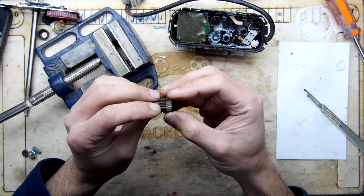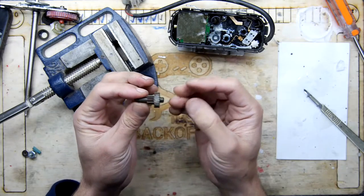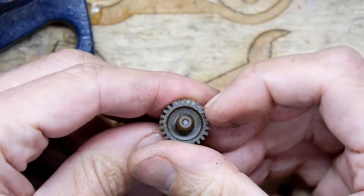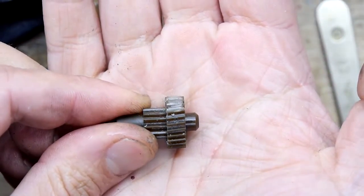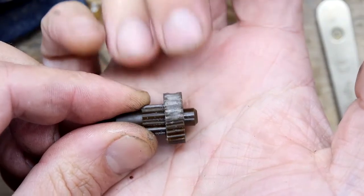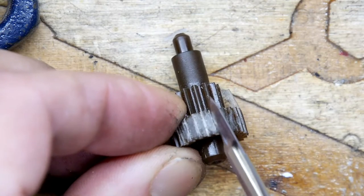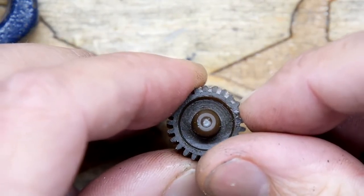Hi, I'm Andrew Armstrong and welcome to the back of his Teardown Lab. Our gear of brokenness, which will hopefully be a gear of fixedness when we actually cast a new one, has been curing for about an hour. You can see the resin I applied is there, more or less filling up those gaps. There's about one tooth I'm not quite happy with, but the rest is pretty good. I've just taken this knife and very gently crafted out a new tooth in each one — it's a very shallow tooth, more just a dimple.